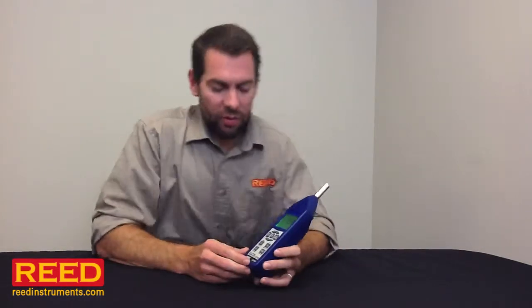So now we're back in the main menu. There's a couple things we can set up here. You're not an expert, you're not really sure what all these settings mean — let me walk you through this. In general, you want to be on A. That's closest to the human ear. There's reasons why you might want to be on C, but you probably know what that reason is. So if you don't know, stick with A.